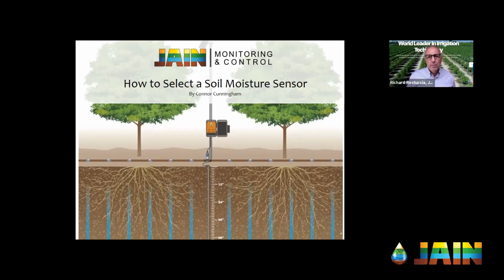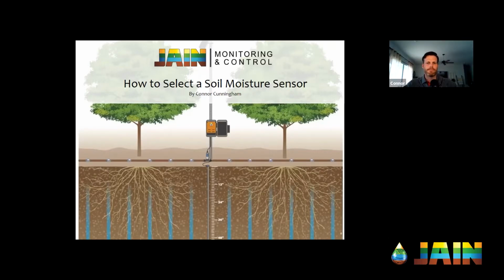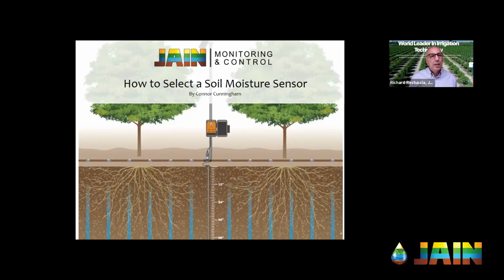Yeah, so one of the things that I wondered about when I started to really look at soil moisture sensors, there's a lot of different ones out there. Right? So, not specific manufacturers, but what are the types of soil moisture sensors that you can choose from? I mean, there's a bunch of them. There are, and we really don't have time to go through all of them today, but for the sake of time and efficiency, we can break it down into basically two groups. We have our tensiometers, and then we have our electronic based soil moisture probes, or what people commonly refer to as volumetric probes. Those are the two main groups that we see most commonly in the field with growers, Jane Logic users or not. That's typically what we're seeing as we're working with growers here in the valley and across the western United States.